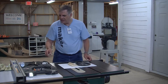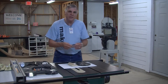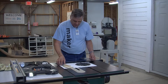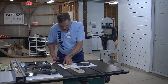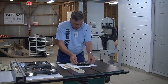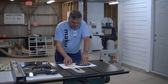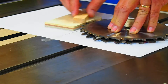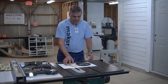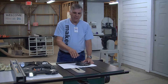I've got a stack that's the same width as this panel. Maybe I should add another 10 thousandths, because if it's too tight we'll squeeze out all the glue trying to get the thing assembled. We need about 10 thousandths of clearance. So I'll put another 10-thousandths shim in here and test it. I can feel it just skip over a little bit — that's pretty good right there. This stack should fit this very well, and our next step is to mount it in the machine.